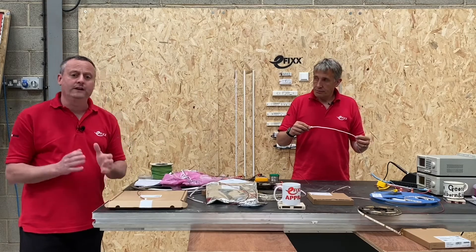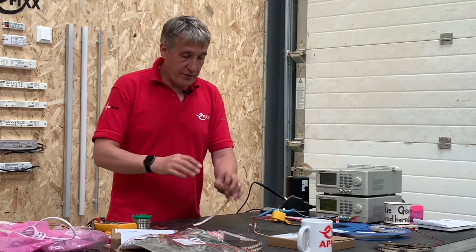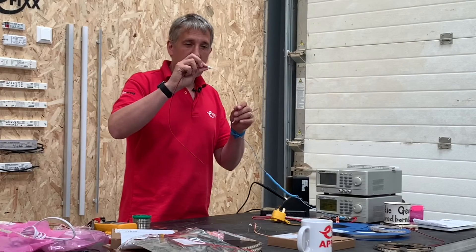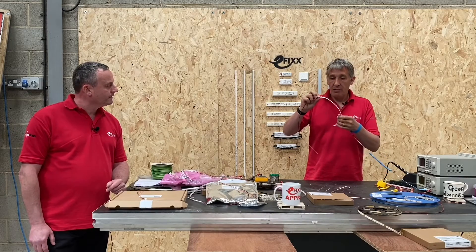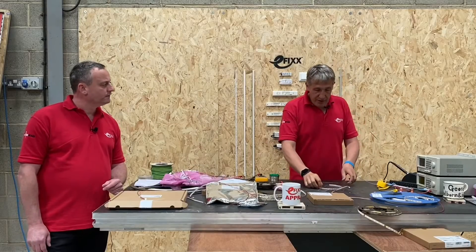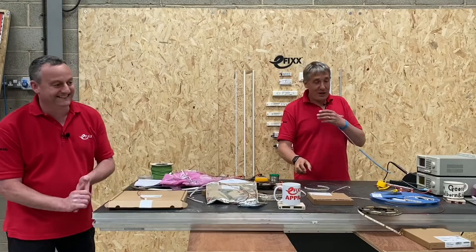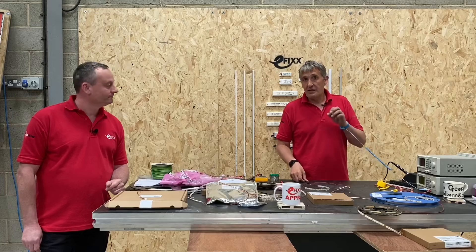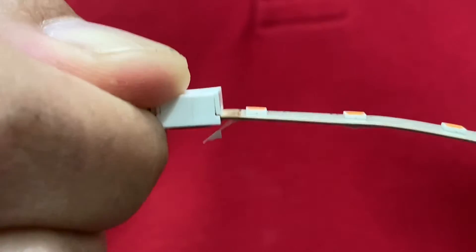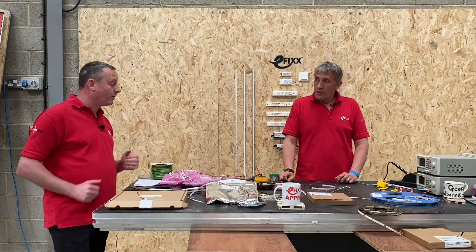We can see why the IDC is the electrician's go-to, but what's the advantage of soldering? Solder creates an incredibly slim profile — if you're really tight on height, say under cabinet lighting or small cabinets, the IDC connector does take up some space. Osram's general advice is: if you're installing in a place that's incredibly difficult to get back to — say a high corner needing scaffolding — use a soldered connection. IDC connections, depending on how well you make them, can be a weak point in the system. For a permanent connection, solder is recommended.